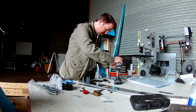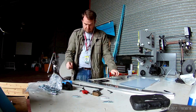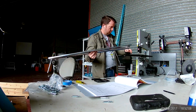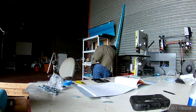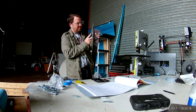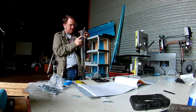So now we move on to the front spar. This is actually a little bit backwards in time — as you'll notice, there used to be a bandsaw and motorcycles. Here's the first time that you'll cut any metal. There's this small double plate that you put on the front of the front spar, and then you mark the bottom and cut the bottom off. I thought about using snips and I've tried and practiced, but it's just a complete and utter mess. Band saw is the only way to go — one cut, clean and done. Then it's just a matter of cleaning the edge, clecoing everything back and making sure the bottom's aligned.